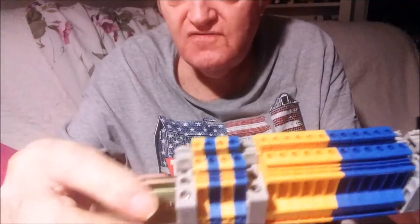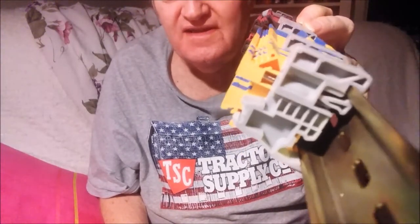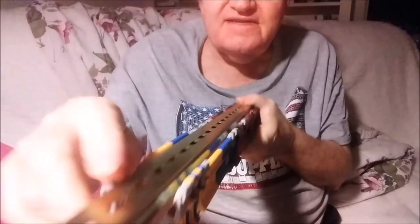Over here we'll have the green bond wires. These end barriers here are a different brand — something I already had. They don't match the outside shape, but they cover up the electrical contacts completely. They have two screws that come down beside the two locking pieces, and that pushes them towards the DIN rail. Speaking of DIN rail — this is called a hat section, because if you turn it upside down it looks a little like a Panama hat. This is standard height; you can get C sections and various other kinds.